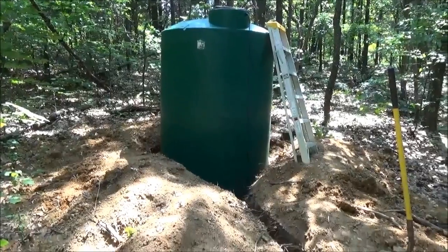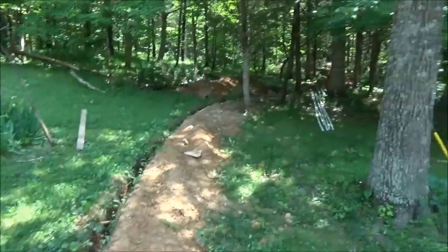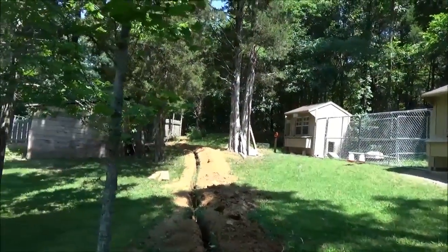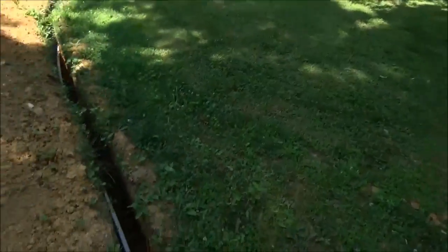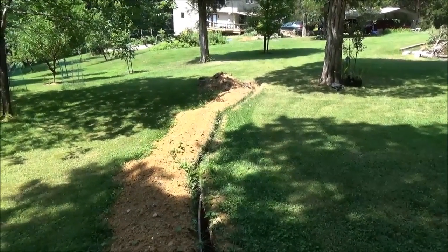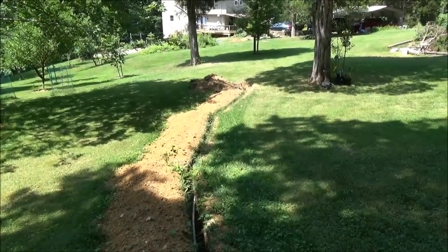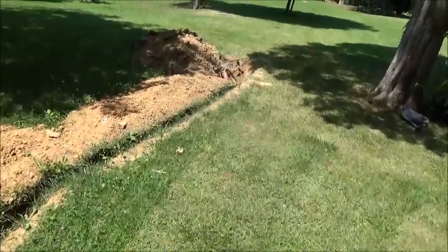We can see the condensation line on the outside of the tank — we're about a third of the way full now and we'll be full in a couple hours, which is always a good feeling. It's about 500 feet up to the tank. We tee off and put a hydrant for the chickens, then another trench goes down to the garden and a garden sink to prep and wash vegetables. There was some existing plumbing for a building that was going to go in this location, so we tied on to the conduits and water lines already here, avoiding having to trench all the way and tear up the lawn more than necessary.